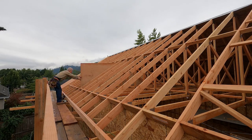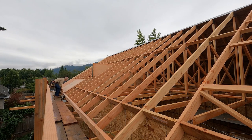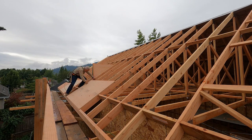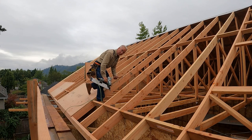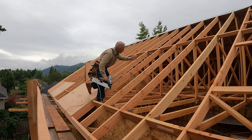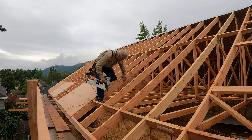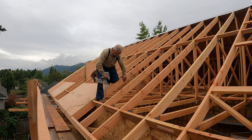This is just another one of those cases that comes up a lot in construction — not every time, but many times: if it looks good, maybe it is good. So if you drop a sheet and you've got a truss that's a little crooked or the layout's not quite right — in this case it's just a little bit short of where I would like it, like a quarter of an inch — and you've got to move it over, it's hard to do when your trusses are blocked. But if you're around six feet tall, maybe the distance from your knee to the toe of your boot is just right, so you can put it against the previous truss and just flex your foot a little bit, push that truss right over where you want it, and bam.